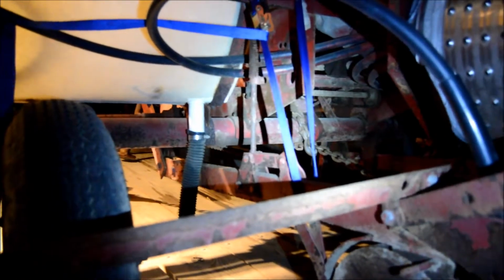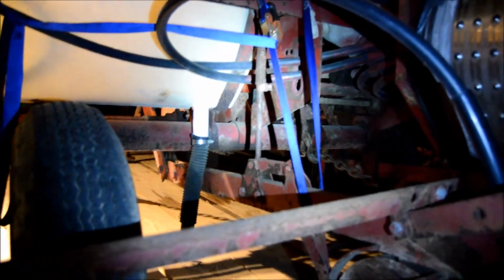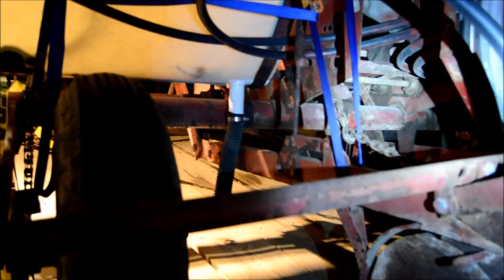I'm going to pull both augers out. They unpin right there at the center, so I'm going to unpin it, pull the augers out of both sides, and replace all 4 chutes. The metal housings in there cost like $250 a piece, so it's a lot cheaper to put a $6 piece of PVC in.